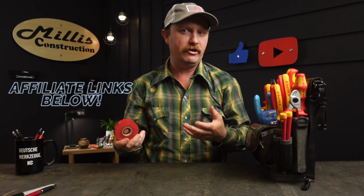So if you've got a wire you need to label while you're changing a breaker, anything else, whole bunch of breakers, you can quickly label something so you don't lose your place. If you carry black tape only, it's a lot harder to see what you did unless you also carry a white Sharpie. So that's what I do. There's always a multicolored piece of tape on a bag so that I have something I can label with quickly.